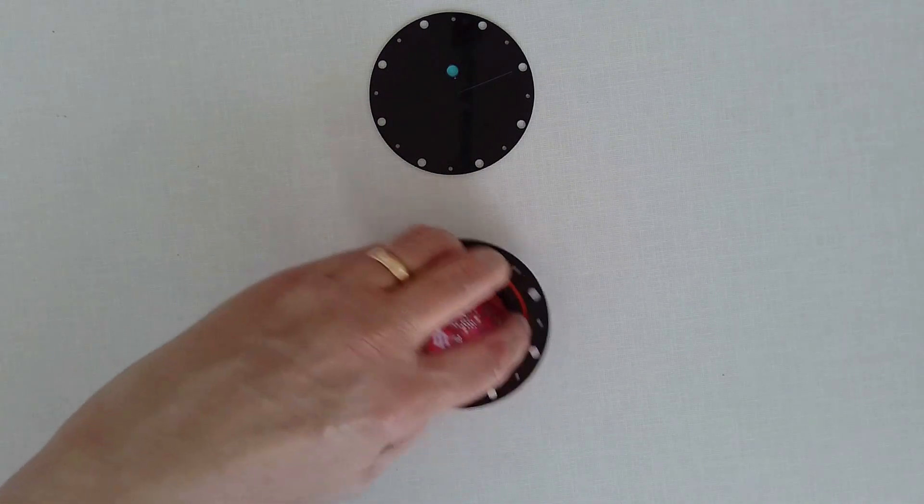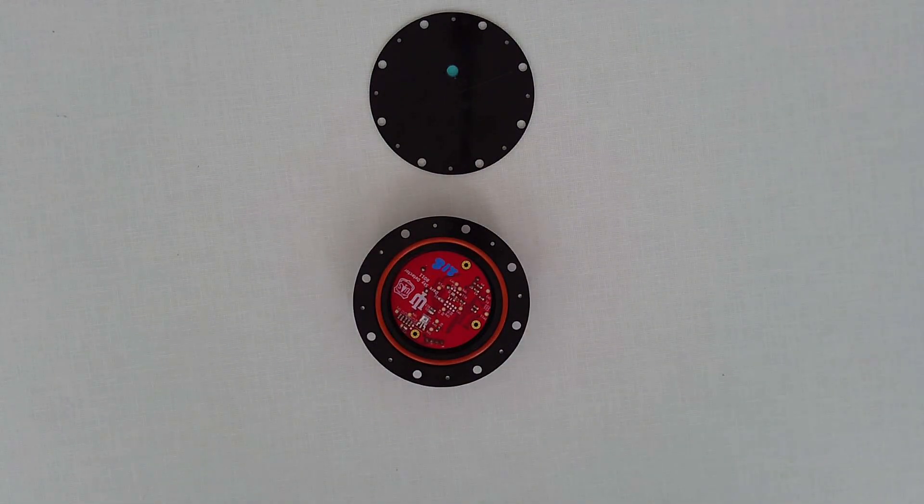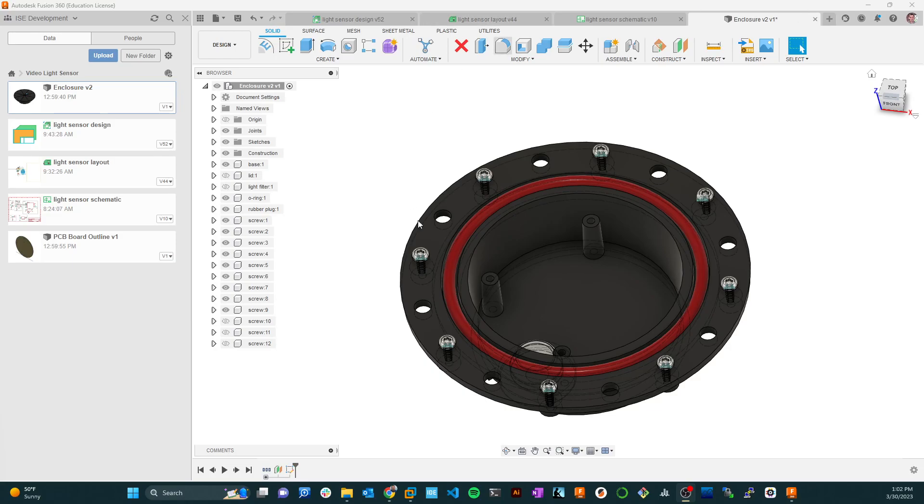For the board we're making, we're putting in a little coin cell — there's going to be a lot of room in the cavity for that. The coin cell is good at least for an early prototype to play with. The problem with coin cells in general is that at cold temperatures their ESR jumps up, making them not particularly useful down in the sub-zero range where the light sensor sometimes ends up taking data.